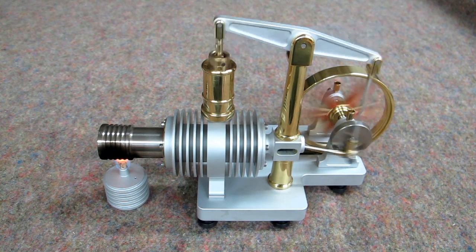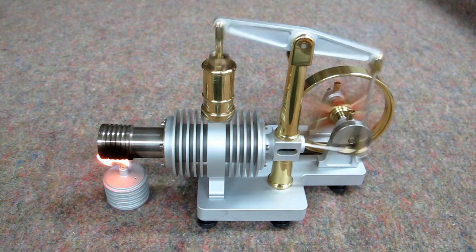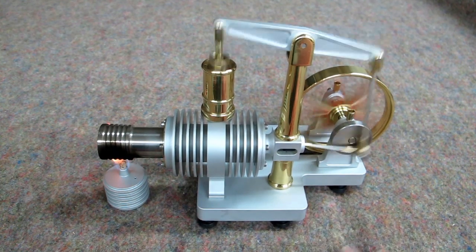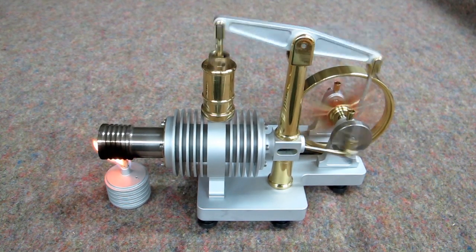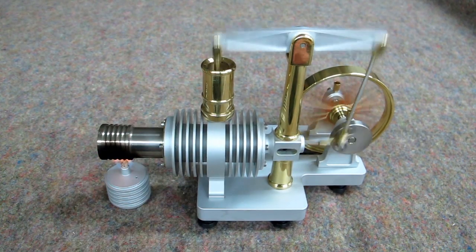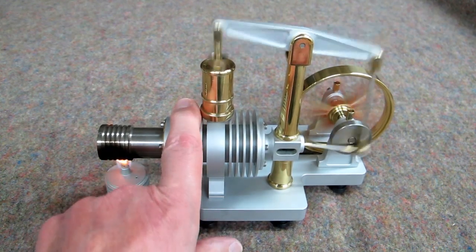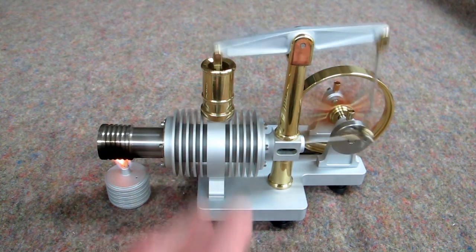It's a quiet engine, somewhat mesmerizing to watch. On a solid surface it doesn't move at all — I'm on a little bit of a cushioned blanket here, so it does move slightly. On a lot of these engines they have a rather short run time because as this heats up, it starts to bring heat back into the heat exchanger section and the cold cylinder will get hot, and that all tends to slow it down. This is quite large, and this will run for 10 minutes or longer. At 10 minutes this was still cool enough to put your finger on it. So this does a very good job of recooling the air that comes back in here and keeps this thing going.